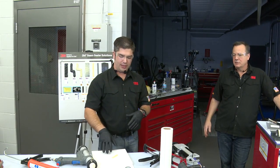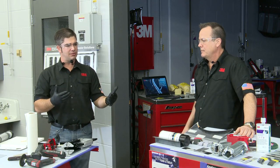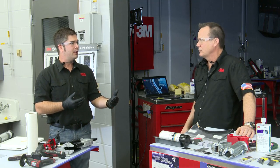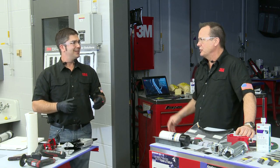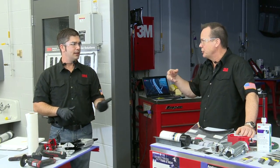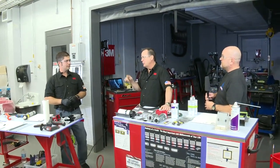Some people will say, well, I don't prefer it because it's too thick, kind of sticky a little bit, which goes back to what the technicians are used to working with. So we offer an MSP sealer, which is a little bit creamier. It gives them a little more flow to the product. More of a mayonnaise kind of consistency. Yeah, exactly. But it's still got a heavy enough body where we're holding our textures and our shapes that we're trying to replicate. Easier to brush, easier to tool and shape. Absolutely. So think about that. MSPs, a lot of guys don't really know what that is.